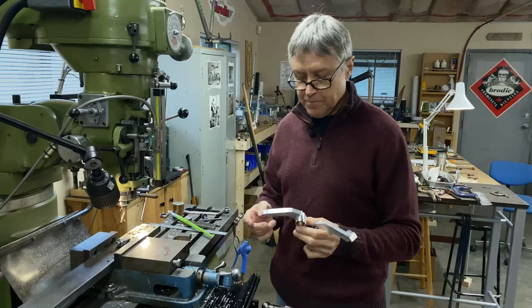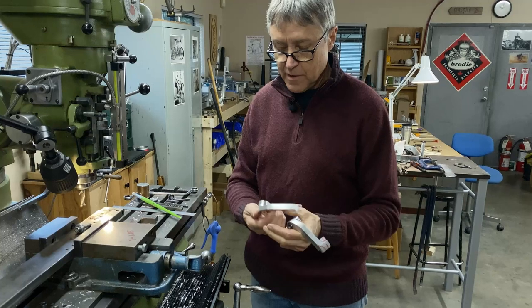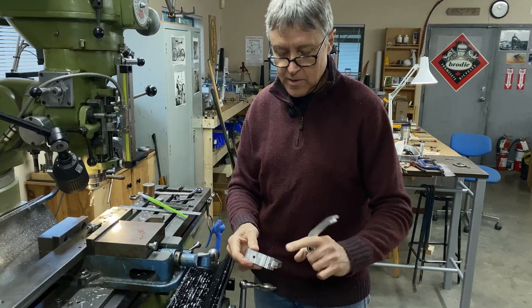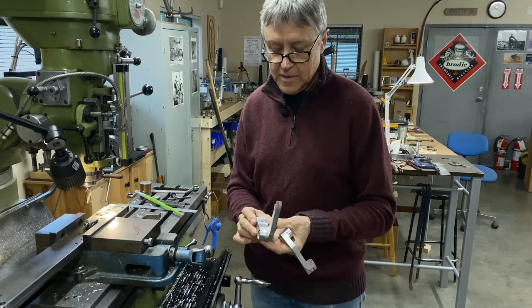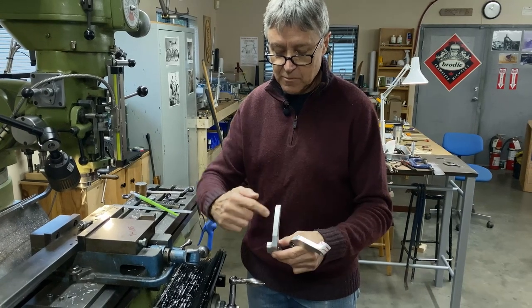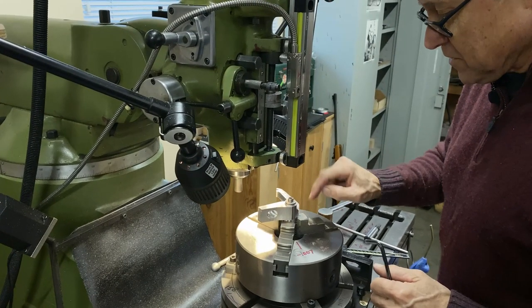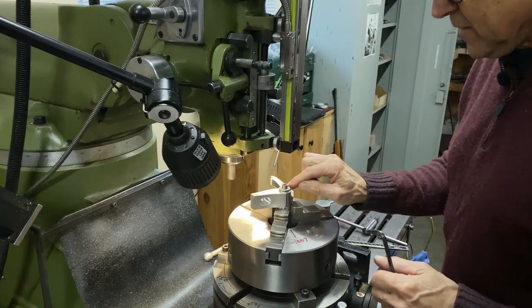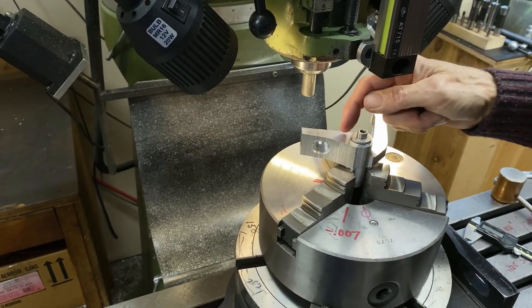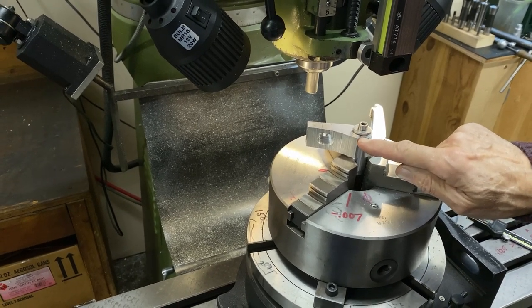I think what we'll do is put the rotary table on here and thin down each of these sections — one, two, three. These two are a little deeper than what happens here. I've got to match that radius there, because that radius is the size that I want. So I've got a ball end mill that's going to come around and match up to that radius right there.